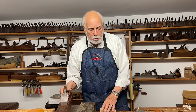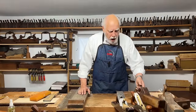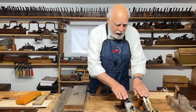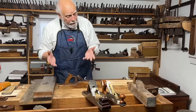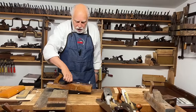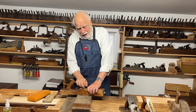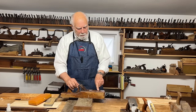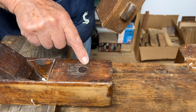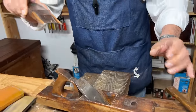Let's take a closer look at these jack planes. The wooden ones are a little obscure if you've never seen one before — unlike modern ones with screws and nuts that make it obvious how to take things apart. You'll notice that the wedge and iron are firmly in the sole. The way to get them out is not by twisting — that risks damaging the sides of the plane — but by simply hitting the strike pin with a mallet or a hammer. You can see it comes out simply.